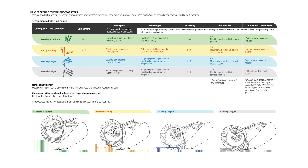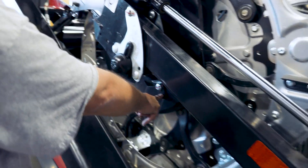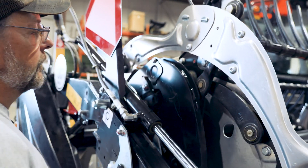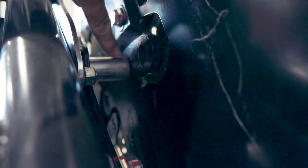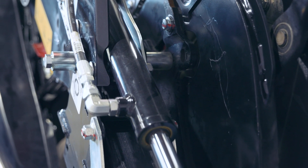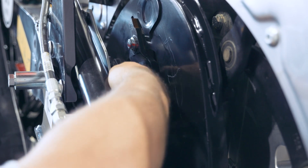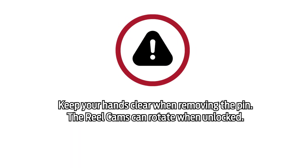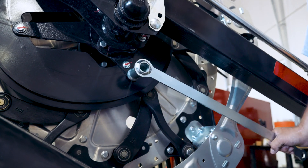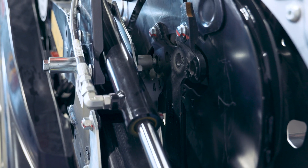Here's how to change your reel cam position. This is the pin that locks it in place, and this is where you put your tool to rotate the cam — your different positions are right in there. There's position one, we're currently in position two, and we can go all the way to position four. To rotate the cam, use the multi-tool to unlock the pin by rotating it into the unlock position so the pin disengages from the cam. Caution: keep your hands clear when removing the pin, as the reel cams can rotate when unlocked. Now we're in position four — just re-lock the pin.